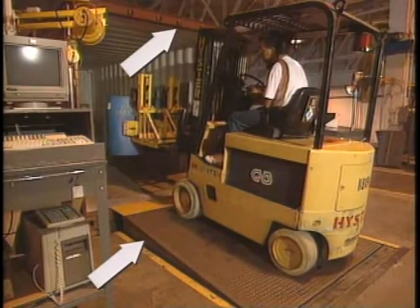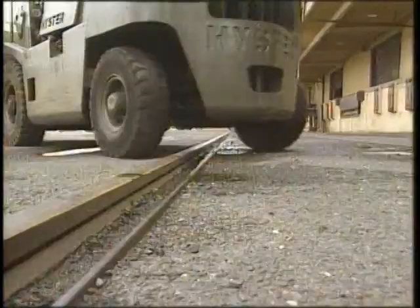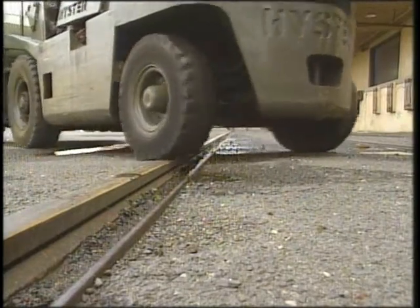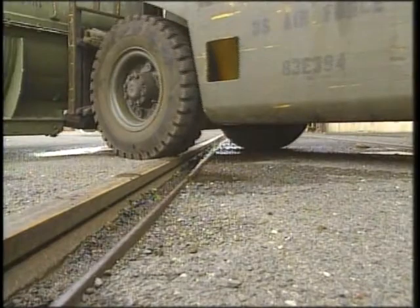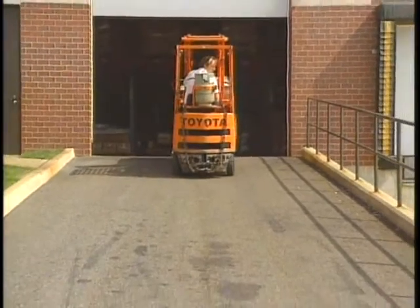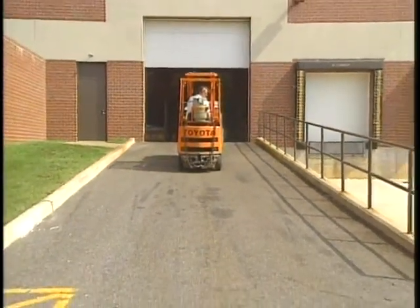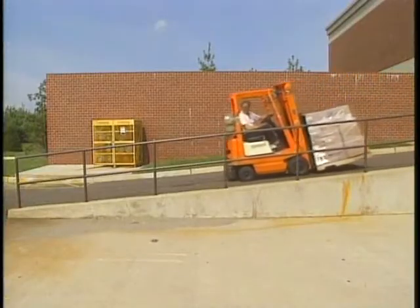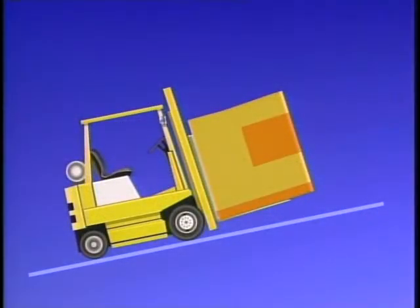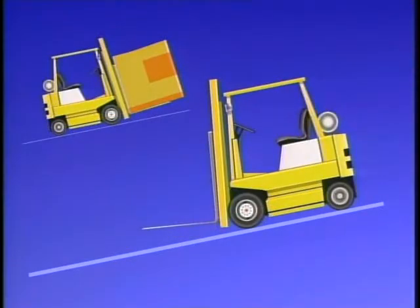When you see any of these hazards, your forks must be high enough or the mast or load low enough to clear them. Scanning ahead, this operator sees railroad tracks. He has reduced his speed as he approaches the tracks. Note that the operator approaches the tracks at an angle — the correct technique. Now let's look at an operating area that requires additional safety considerations: a ramp. When approaching a ramp, approach it straight, not at an angle. And, as on all grades, keep your speed very low and stay away from the edges of the ramp. When operating with a loaded truck on a ramp, the load should be upgrade. On a rider truck without a load, travel so the forks or lift section are downgrade, so the heavy weight on the back of the truck is upgrade.